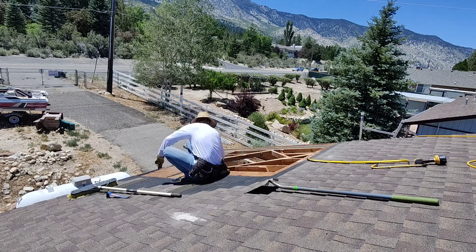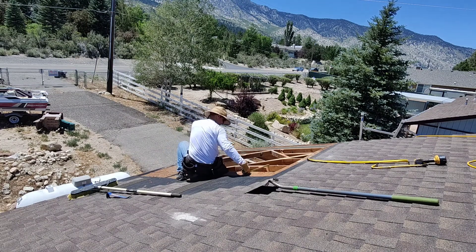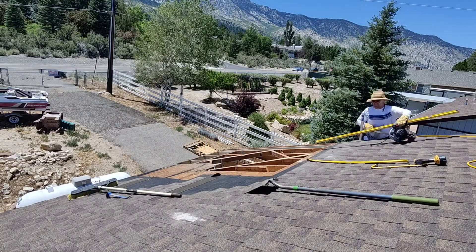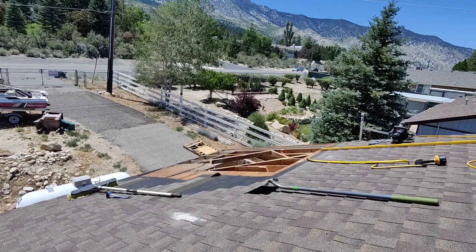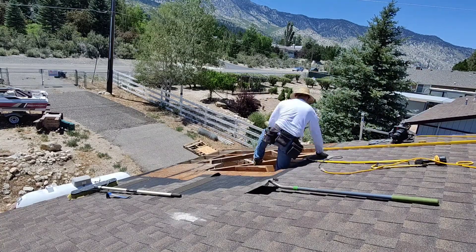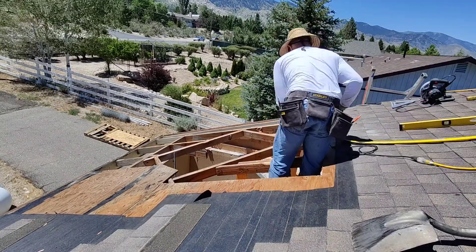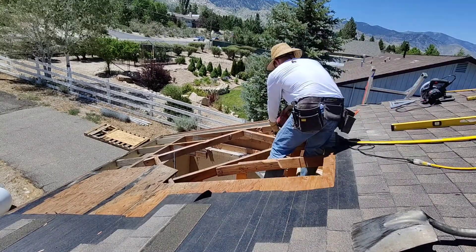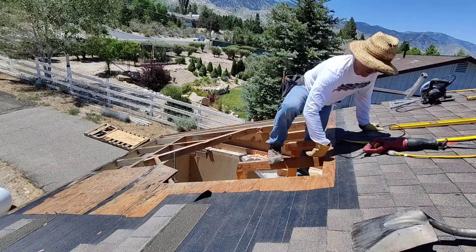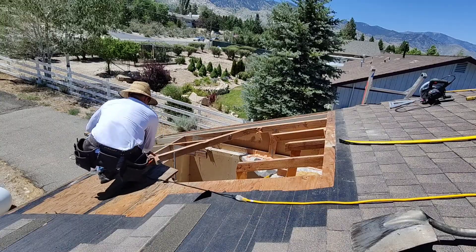So now I'm measuring where the next truss is and where I'm going to make my cut. I just marked it, thinking my trusses would reliably be running 16 inches on center, then I get my circular saw and my long straight edge out. I got distracted, got the saws out and just cut away all those rear-angled pieces of 2x4s. I only wanted to leave behind the actual trusses themselves — you can see them there, three pieces that were all chopped off by whoever framed in this chimney opening.